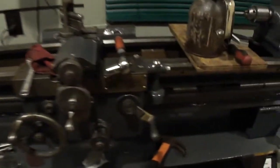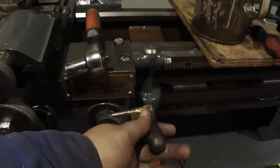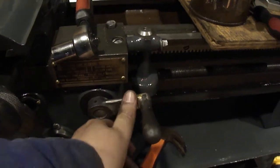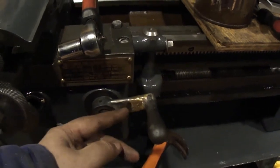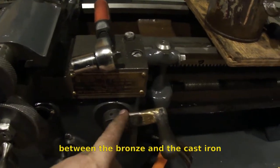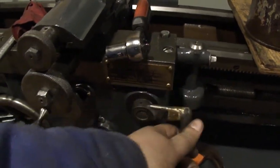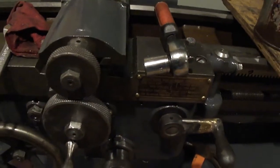The only thing that's left to do now is this, which is the lever for the half nut. I got to take my grinder and polish this up to get rid of the black oxide, take it back to silver. Then I got to do some Bondo work on it because it has some gaps and stuff — transitions between the braze and the steel, and other little defects. Then I'll primer it, paint it, and give the silver handle a clear coat. Then I got to do a pin right here, which is just basic work.